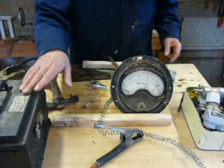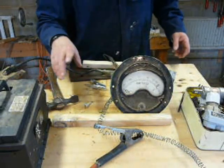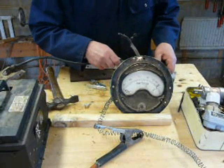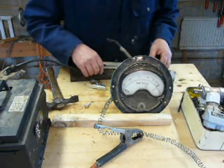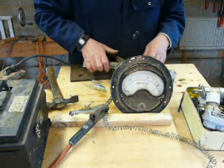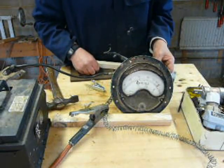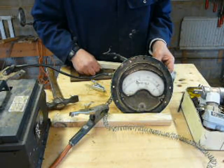Okay, here we go. 12 volt battery. Power to the resistance wire that we've used on other experiments. Then through the meter, and remember we're on 12 volts here, so then we're back to the battery. And it's switched on, and I'll just go like that, and a little bit flows. Okay, so the resistance is too long. So let's try that. Where are we? 30 amps. Things is getting warm and it's not tripped. What's going on?